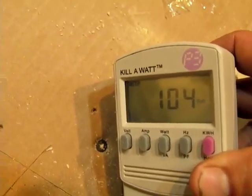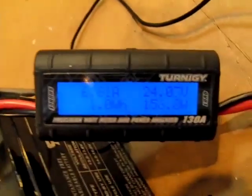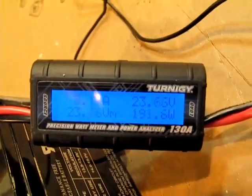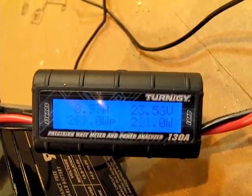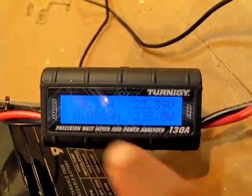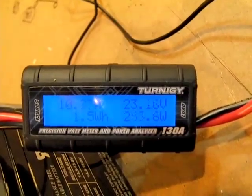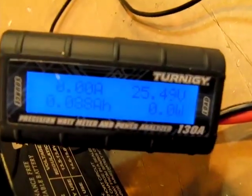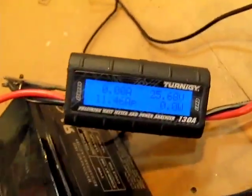So what I'm going to do is update you as this goes up on the grid-tied inverter. Now one of the neat features about this device is you can see that it starts storing some of the data. Right now we're at 253 watts — that's probably as high as 11.5 amps. That's going to start cooking this wiring, so I'm going to drop it off. And that's how this little device works.